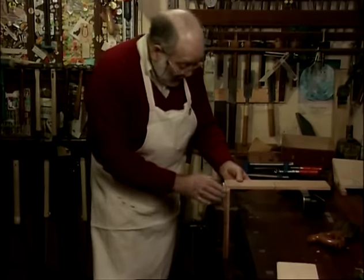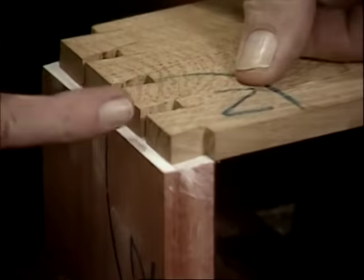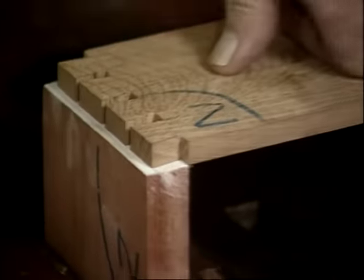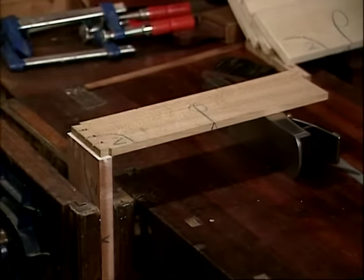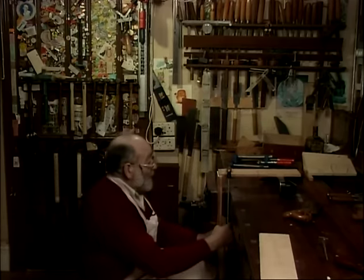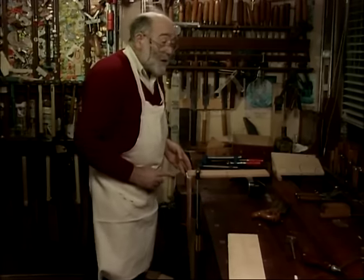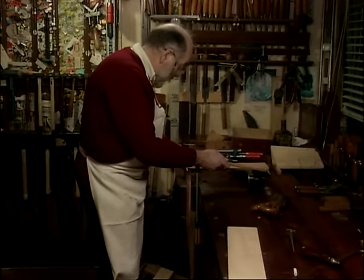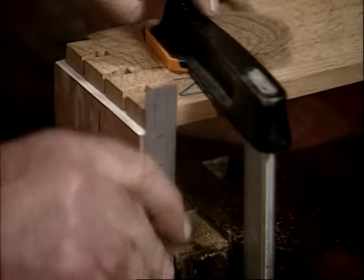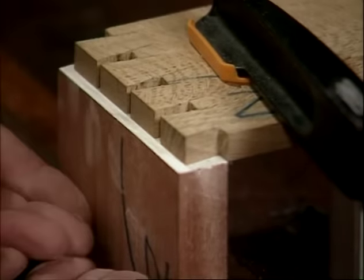Notice the two and a half circle — it's got to be the right piece of wood. We line the front of the dovetails, the length of the dovetails, up with the line that we scribed from the back. Now we need to hold this. Some clever people hold it while they mark it — I don't like that, it's got a habit of moving. So I put a cramp on it and hold it like that. You want the face edges to be in perfect alignment — if you're not sure you can put something across to check. That is the exact position that the side is in to the front, ready for marking.